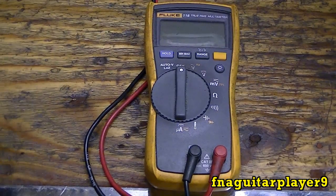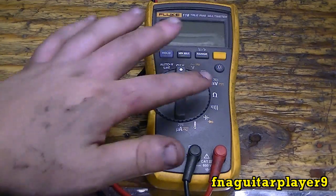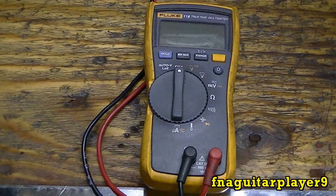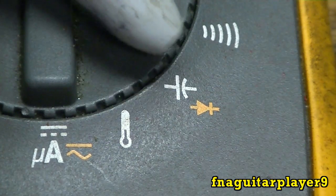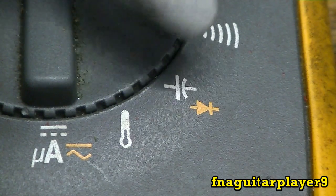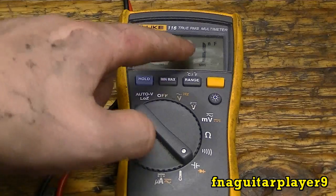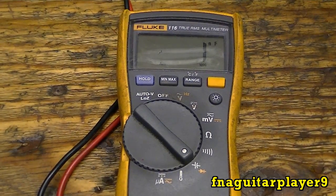You can't use just any voltmeter to measure capacitance. Most voltmeters will only show ohms and volts and won't show a capacitive reading. If you look at the meter, this symbol right here — the straight line and the curved line — is the capacitor symbol. That's the one in white, not the L, which is the diode checking area. Your meter will read in the correct range, either in nanofarads or microfarads, depending on the application.